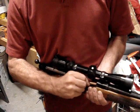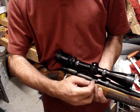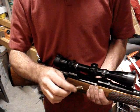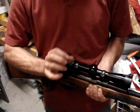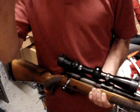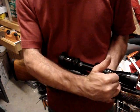You want to make sure every one of them chambers. This one's a little stiff, and that's what you want — you want the whole case from the shoulder back to the head to be completely supported. Even though they're wrinkly looking, all that is going to get ironed out under fire forming. If the bolt takes no pressure to close on it, you may want to run it back through the .375 expander ball and back the die off an eighth of a turn, so you have good pressure from the shoulder to the head.